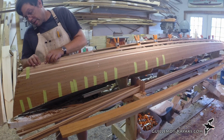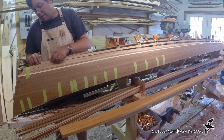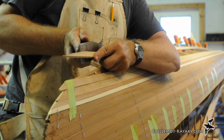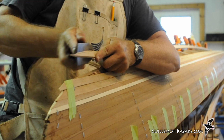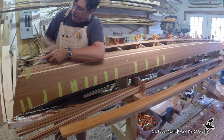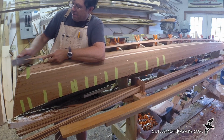I inspect the taper in the bevel. If the pointy toe hits first, I know to concentrate first on that end. If there's a gap at the top, I'll adjust for that. I hold the appearance of that fit in my mind as I place my plane against the wood. By reproducing the fit, but replacing the plane for the keel line, I will shave away until the fit with the plane is tight. This should mean the fit with the keel line would also be tight.